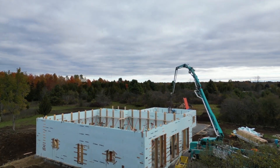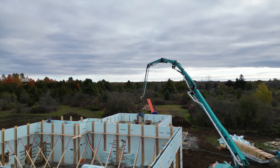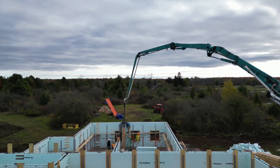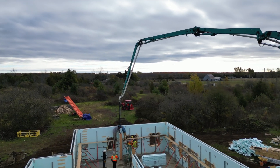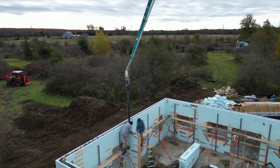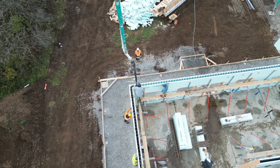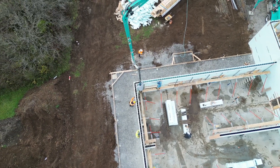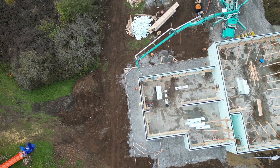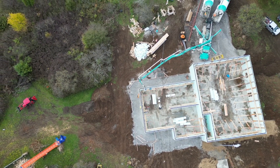They're starting on the house now. In case you hear any weird background noises, I'm making this video from the trailer right beside the construction site. The individual walls include some interior walls that are also ICF. It's a lot easier on the house because it's only a nine-foot high wall — for those Makita or DeWalt vibrator tubes that they dangle down to move the cement around, it's an eight-foot vibrator in a nine-foot wall, so it's going to do the job. The only hard wall was the 15-foot high garage barndominium wall.